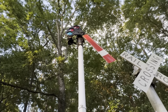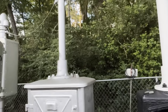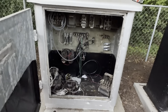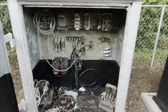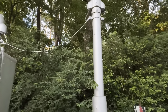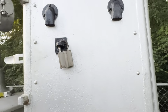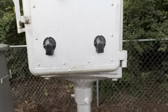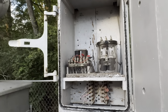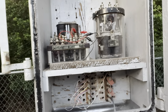Next is a GRS cabinet that I'm just housing a couple of timer relays in — they are thermal timer relays. There's the finial and weather head; the GRS logo is outlined in black. Next is the first of three what I like to call 'Union cases,' produced by Union Switch and Signal. The Rock Island was a big user of them — in old pictures of the Rock Island you may see these in the background in service. This one has an NF style flasher relay in it as well as a DN-11 for a very simple crossing setup.